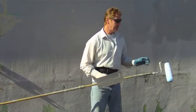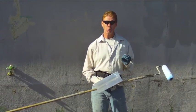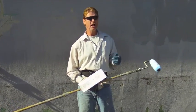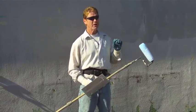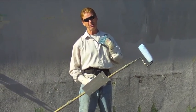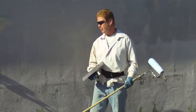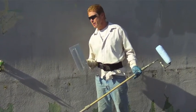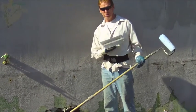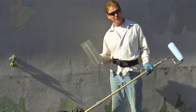And again, with Weld Crete, I recommend if you're going to do it, you dilute the Weld Crete half and half. You take 1 gallon, you make 2 gallons. I had a fireman several years ago, about 12, put it on straight. I came out to do the job and I said, oh man, you went full strength, didn't you? What happens is if we put a color coat over full strength Weld Crete, it will hairline crack. So don't do that. I generally do all my own Weld Crete now because I've had it both ways, where fellas put it on too light, too thin.